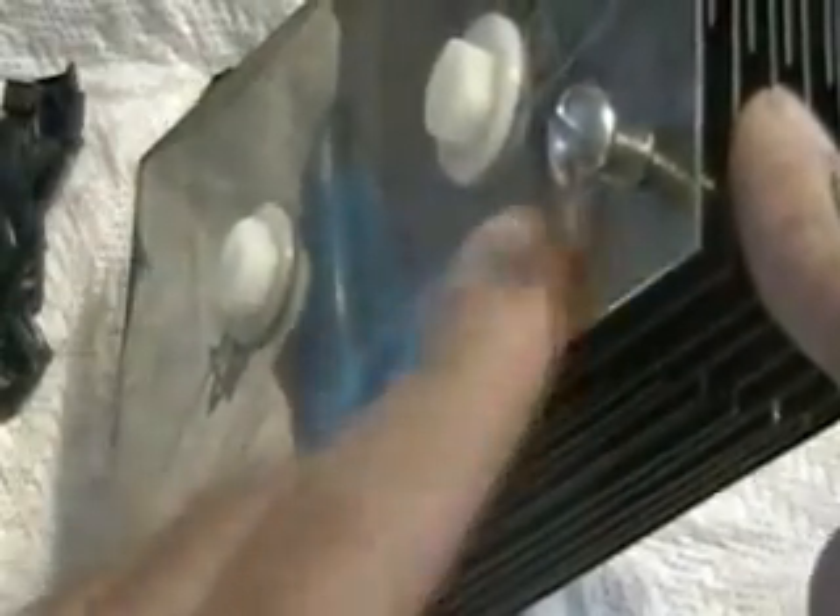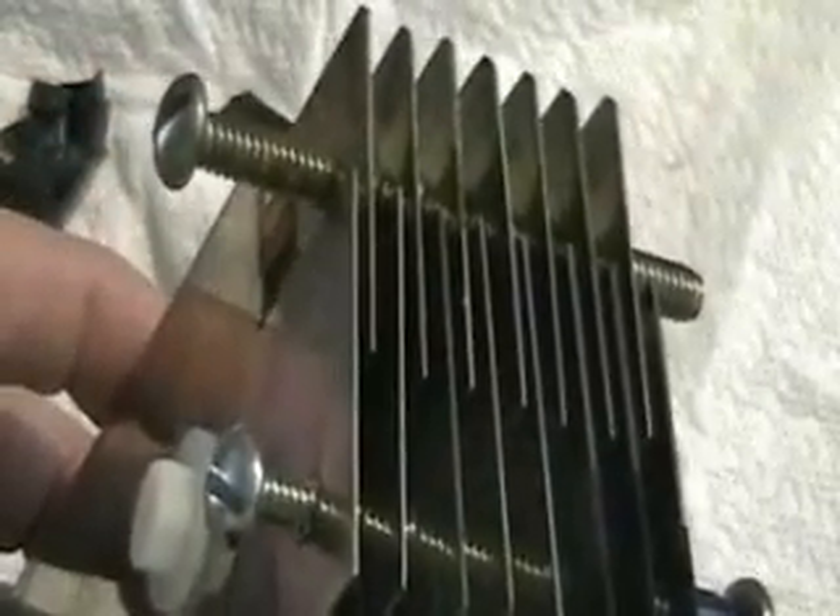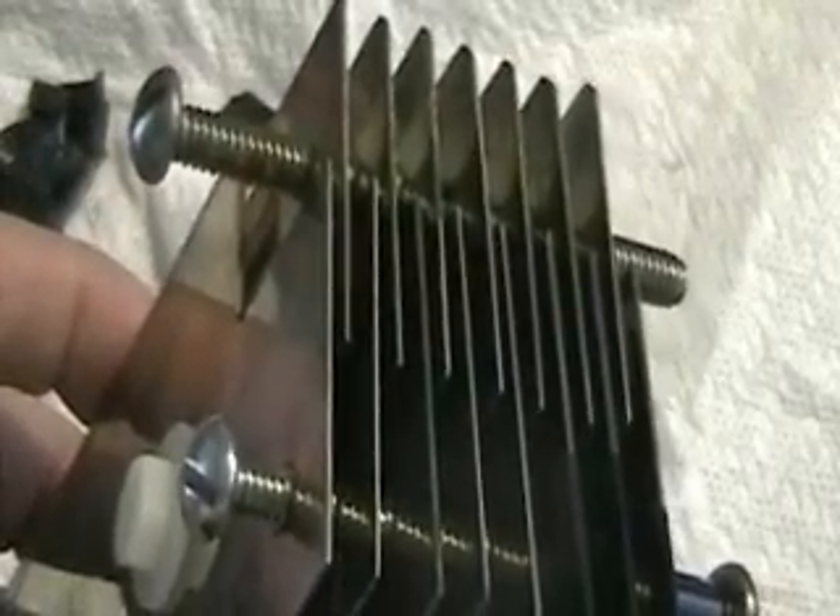The other thing — this system right here — these plates have been in the lye, which I use. Actually, I keep it in that lye solution all night. In fact, these plates are in it all the time. I take them out just to do things like this, but 99% of the time it's in lye. And you can see the plates haven't suffered any problems whatsoever. So I use lye and distilled water.